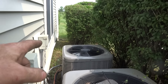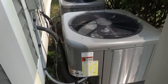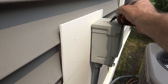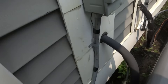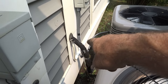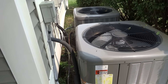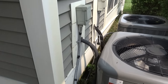This one's facing this way and the other one's facing that way, so I can access that one through there and this one through here. I put that plastic piece - 10 feet - so the condensate is going to come in here and then dump out there on the other end. Because this is always wet here - it was dumping right here. We're going to get the condensate away so this will dry out. Before, moss was growing and everything. I kind of lined the backs up.